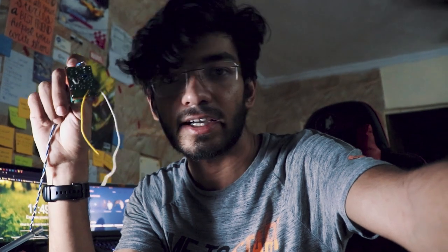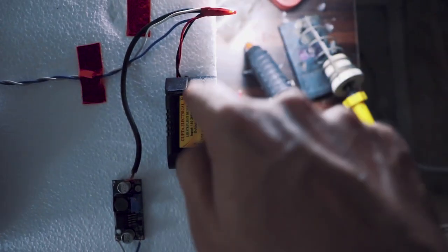Test three — I tried some more repairs, it kind of had a spark and exploded, so this one's dead. I have another one but it's rated for 12 volts and for some reason puts out 20-odd volts — don't quite understand why — but I just have to take the risk. I spent last night trying to repair all the power supply circuits I had and none of them worked. So I went out this morning and bought two separate 12-volt power supplies, because I found out the Peltier was drawing so much power there was a significant voltage drop, and because of that the fans couldn't run.